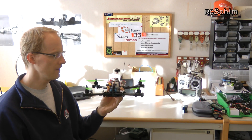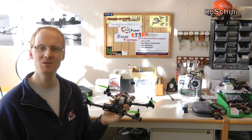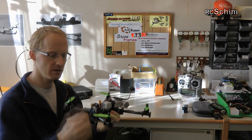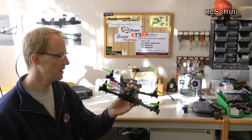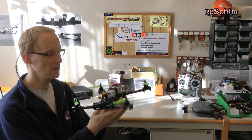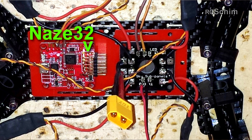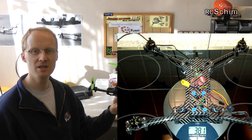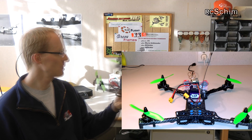I realized I had a lens with no infrared coating on the inside. So if you have a Fatshark with ugly colors, it might just be the wrong lens type. I had to unscrew the top plate and fiddle around with the cam, but it worked — about half an hour of work. Other than that, building this quad was really easy and nice. The soldering with the power distribution board is straightforward. I had some issues soldering pin headers for the NAZE32 but that's just because I'm not very good at soldering. The first flights worked on the first attempts.